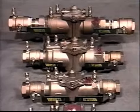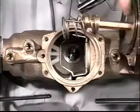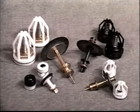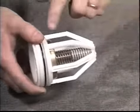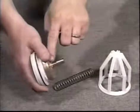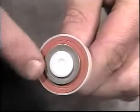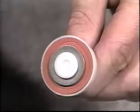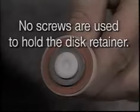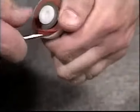While different sizes within the series vary slightly in appearance, they all feature the same basic construction. Access through a single cover — both checks and the relief valve are modular. The check springs are contained for safety and held in place by the module's cage. To ensure accurate seating, the cage guides the poppet along the sides to limit side-to-side movement during flow. It also guides in the center to evenly distribute the spring force around the circumference of the seat disc, thus ensuring a tight seal. The poppet features a large disc retainer to prevent the disc from being displaced during periods of high velocity. To prevent parts from vibrating loose or corroding away, no screws are used to hold the disc retainer in place. The disc retainer is permanently attached to the disc holder. Cut or torn discs must be replaced.